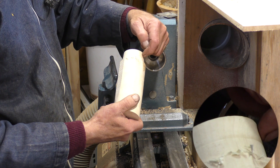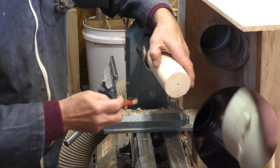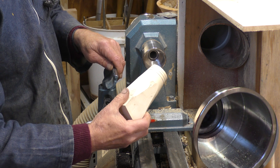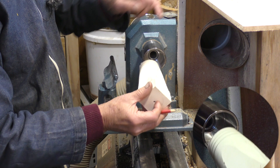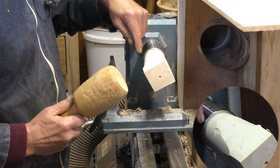As you can probably see, there's just a little bruise around here where the chuck actually fits. The key when you're turning the blank is that this is a very shallow taper. If you're not quite sure how to get it in square — I've done tens of thousands of these — when you're roughing between centers you can mark some lines on there, and when you knock it in you can swing it around and see where the line is in relation to the opening.